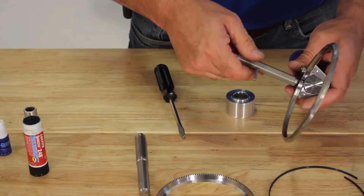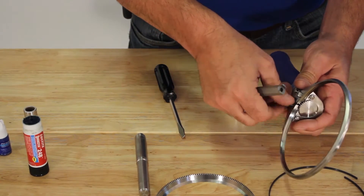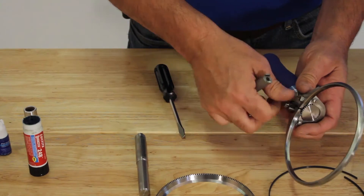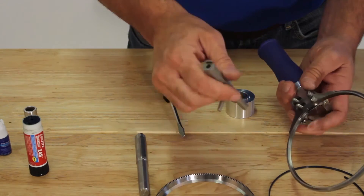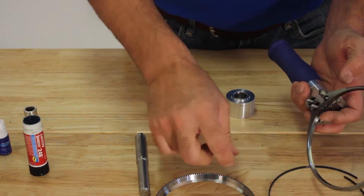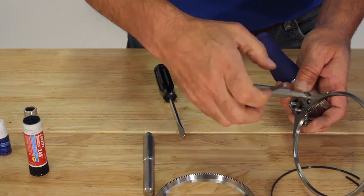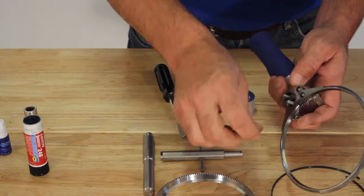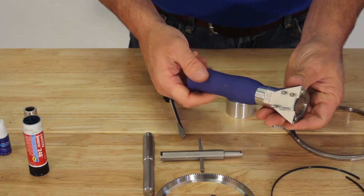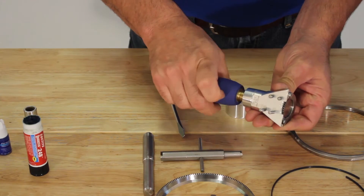For the HP 40 and 50, there are two housing release nuts. The housing release nuts have a nylock insert. To remove the housing, remove the housing release nuts and the housing nuts. When reinstalling the housing, use a medium strength Loctite on the housing studs — only on the side that has the housing nuts, not the housing release nuts, as they have a nylock insert.